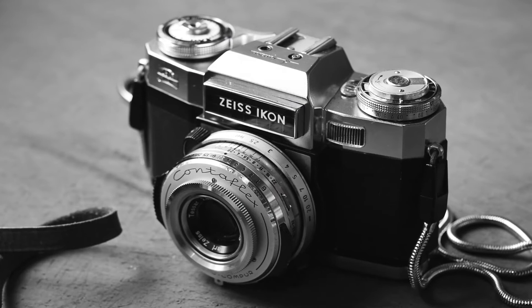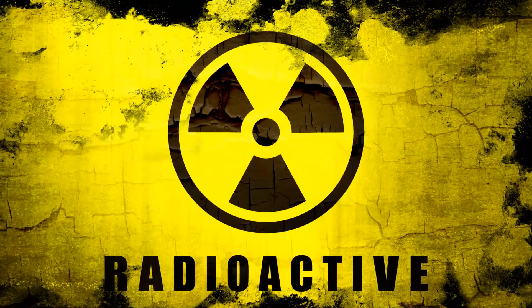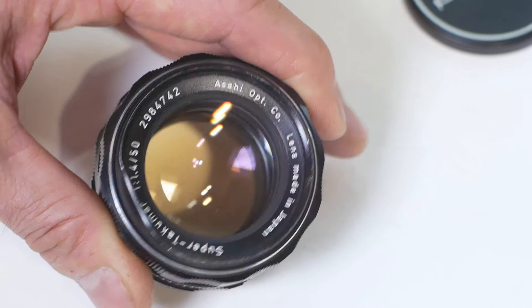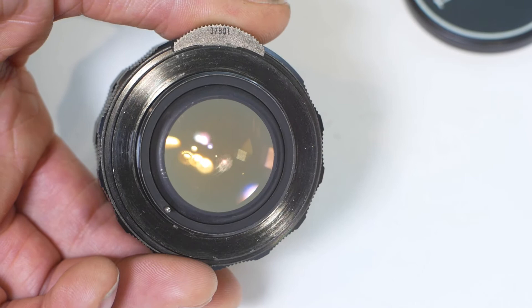There were only a couple of side effects. Firstly, that the lens was radioactive, and secondly that over time the glass can gain a yellowish-brown tint, as can be seen on my lens. This tinting of the glass can be reversed by exposing the lens to ultraviolet light.